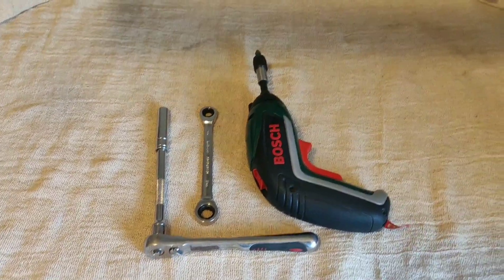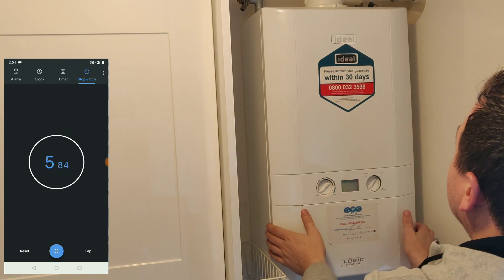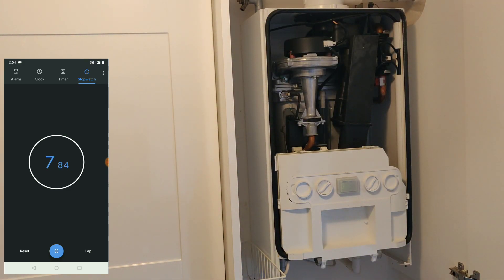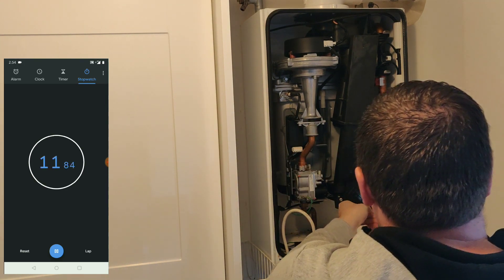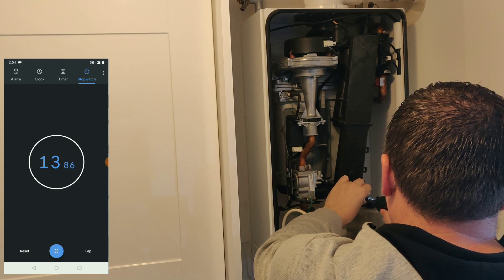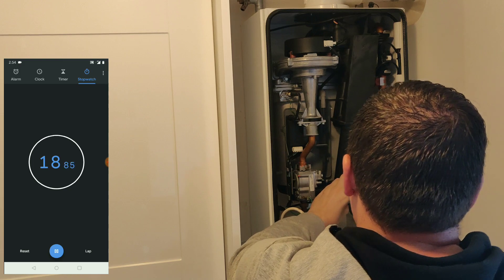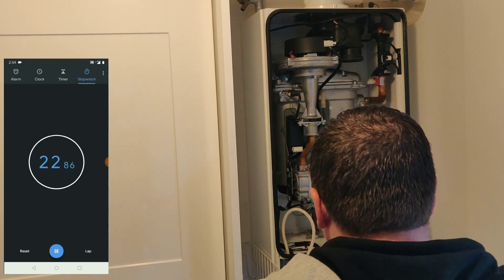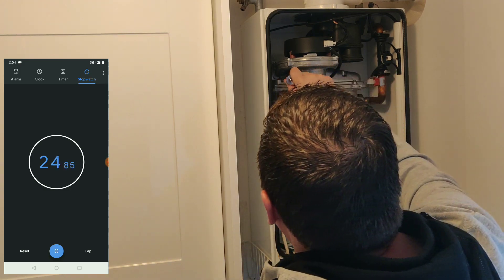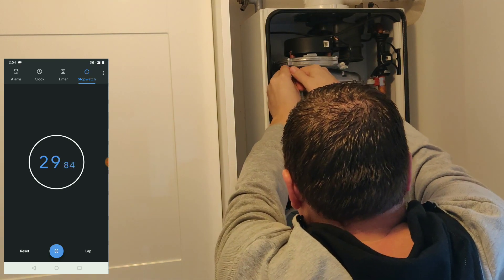These are the three tools I'll be using to completely strip this boiler for service. Two screws underneath with a screwdriver allows you to remove the front cover, drop the front face down, and remove the sump cover plate. Then remove the flue-to-sump turret.